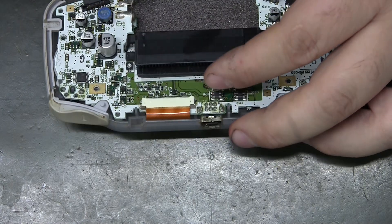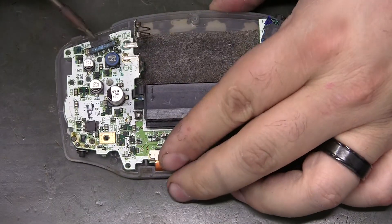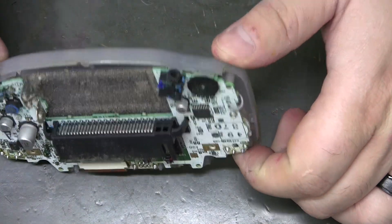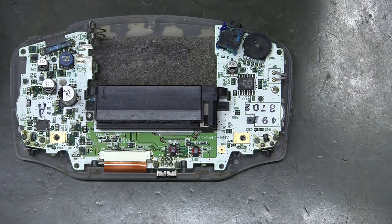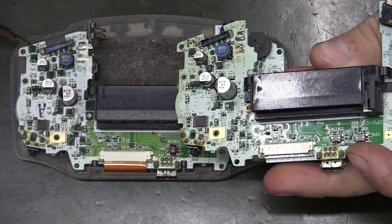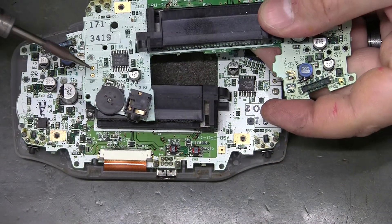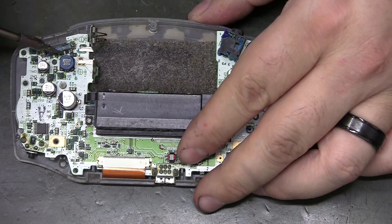From battery positive — yep, that's excellent. Those contacts are right up against the plastic and always super dirty. Look at the corrosion inside — it's awful. I'm surprised the contacts aren't in worse shape. The audio jack is in really bad shape; make sure that one gets used by somebody who doesn't care about the analog audio output. I changed to a conical tip — very fine point — and it made it so easy on the audio part. I just dragged it out, kept filling with solder, and it lit right there.